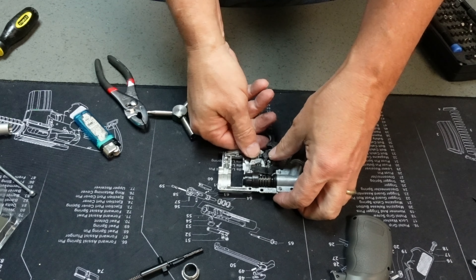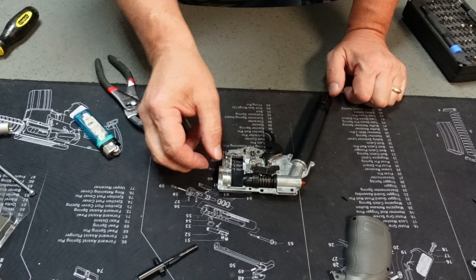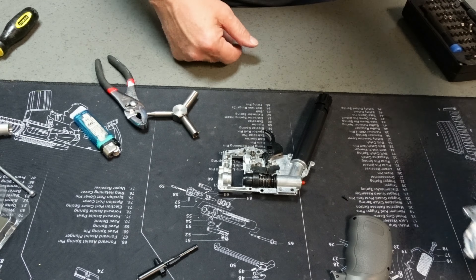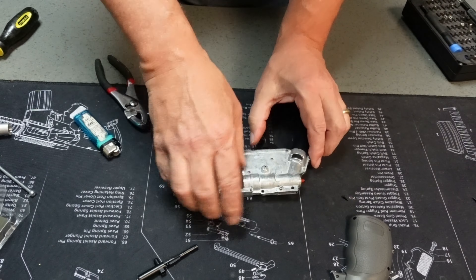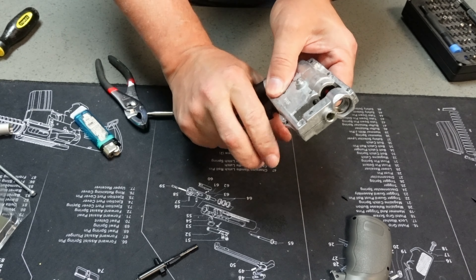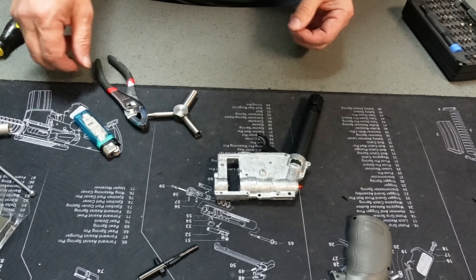At this point, we are ready to reassemble the top and the bottom half. Go ahead and put your guide — this is your retainer for the drum. It moves forward and back, it floats, and there is no way you can put that in wrong. Now let's go ahead and put our top half back on and slide it into place. Once you get this all down and secured and you can see you don't have your seam anymore, test everything — make sure you're seeing the advancement. Everything is pushing up and in like it should, and everything is moving freely.